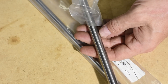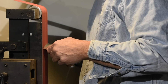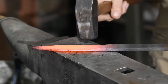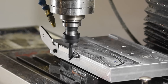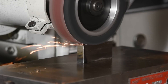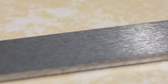The key to figuring out what kind of steel you want to use is to look at the attributes of the steel and see how it fits your application and the tools that you have. These would include functional qualities like abrasion resistance, corrosion resistance, hardness, shock resistance, edge holding, and hot working qualities, as well as more process-related qualities like ease of heat treatment, stability during heat treatment, machinability, and formability. If a particular steel looks perfect but you don't have the gear to heat treat it correctly, then it doesn't do you a damn bit of good. You've got to get something that is both going to function like you want it to and that you're capable of heat treating.